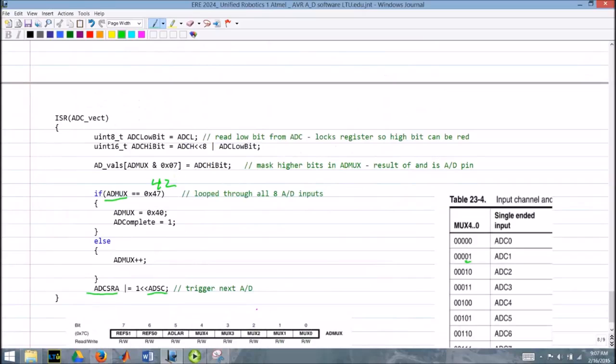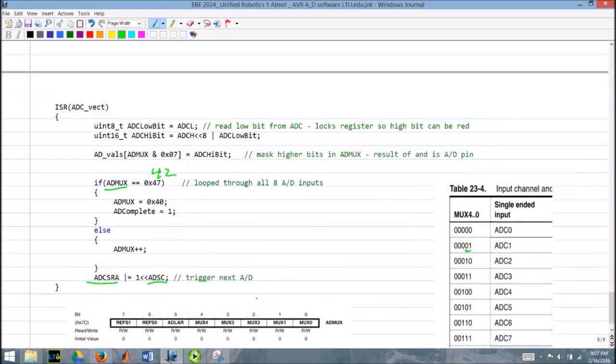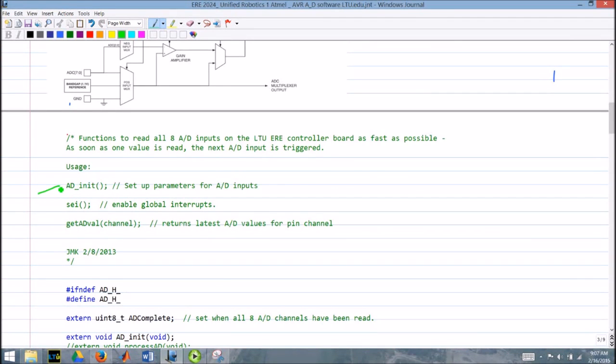Okay. So that's it. That's the whole A to D software setup that I've created for you guys to start with, warts and all. Again, the link in the description will tell you where to grab it if you want to grab it just for something to start with. Most of the work is done in this interrupt vector. In your mainline code, all you do is call the A to D init one time as you're doing the initialization at the beginning of the program. You enable interrupts, and then at any time you want an A to D value for a particular channel, you just call get AD val and magic happens.